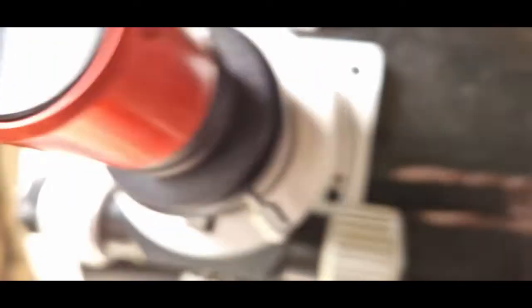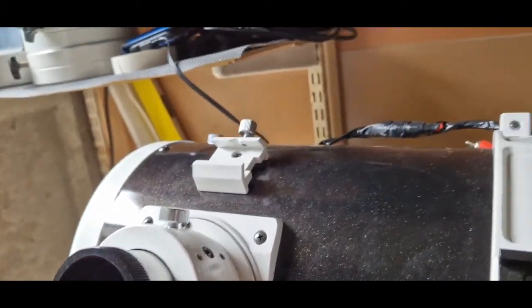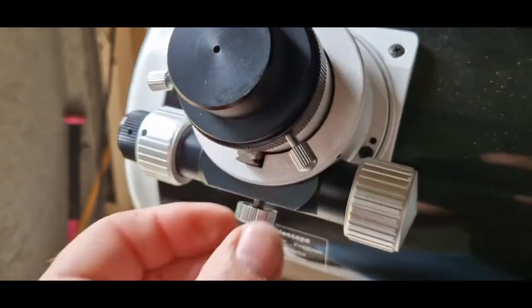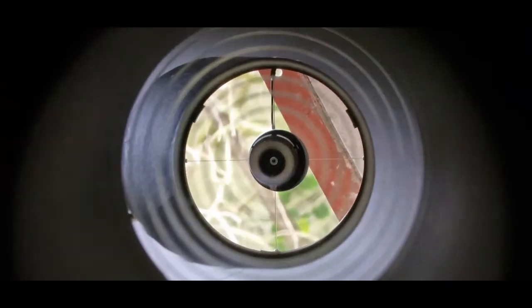There's also a third eyepiece we can use — it's called a concentric eyepiece. I got this from First Light Optics; this is a two-inch version. If I drop that in there and we go to it, there you see the concentric rings all the way down. You can see the secondary centered, the primary centered. And it is easier using a concentric eyepiece — you just look down it and a little tweak and you're done.